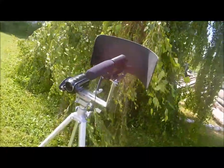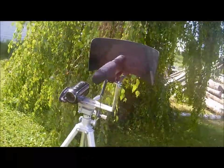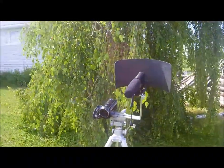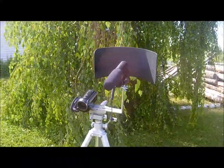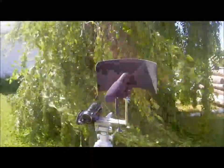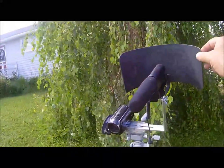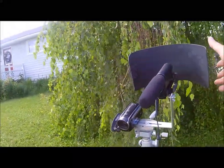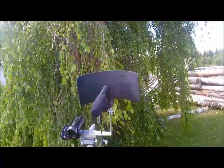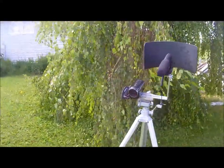It goes up to 500 degrees, so after I've forged the knife or whatever it is, and I've hardened it, and I want to temper it down to a less brittle state, I can do it in my oven at 500 degrees for a couple hours, and it'll bring the Rockwell well down to a level where it's going to be quite solid, but not nearly as brittle as if it was just quenched. But in this case, you can make anything with it. I've made knife sheaths with it. As you can see, I've made a sound catcher parabola thing with it. So I'll do a video on that, because that stuff's like gold. It's as handy as anything.